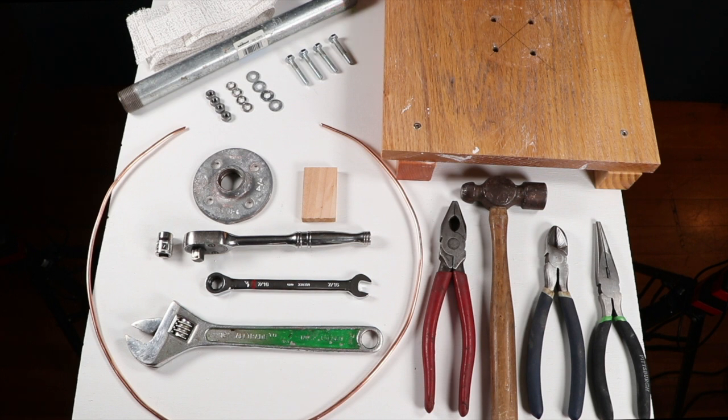So you don't want your coarse threads here to be steel, to corrode with that plaster, which does it pretty quickly, or even cement. Next is going to be your four count here. These are your standard split lock washers. Make sure they are galvanized or stainless. Okay, so you're going to need that as well. So these items here is what bolts this flange to that board.